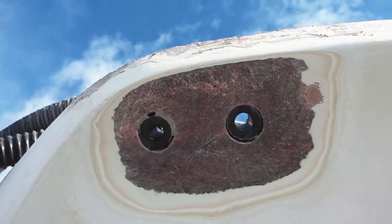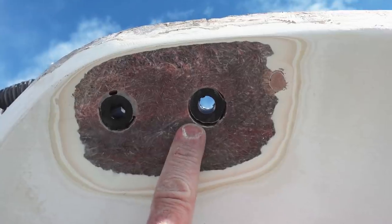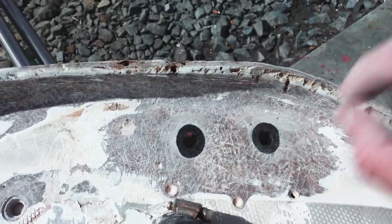Excuse the noise. Those high density polyethylene tubes are really well stuck in. I've just ground back the area to the old parent fiberglass. I'm going to put some double bias tape — some double bias fiberglass, quite thick, strong stuff — straight over the top of those tubes, and then I'll fair that back and access it. That'll give us a cap of fiberglass on either side, just to doubly make sure that that stuff doesn't come out top or bottom. It'll also beef up the area — double bias glass top and bottom will just strengthen everything that touch more.